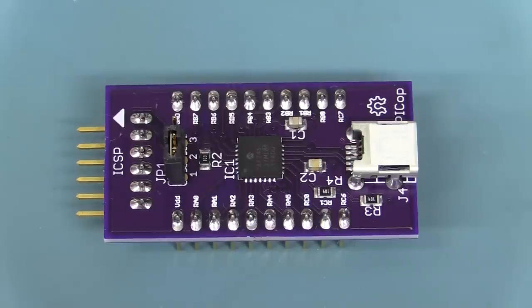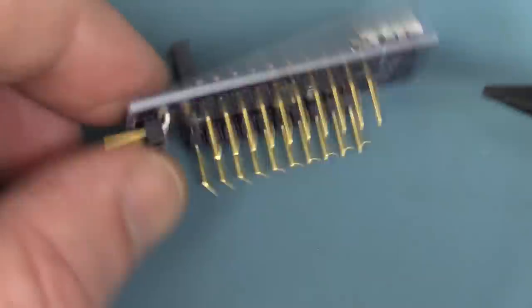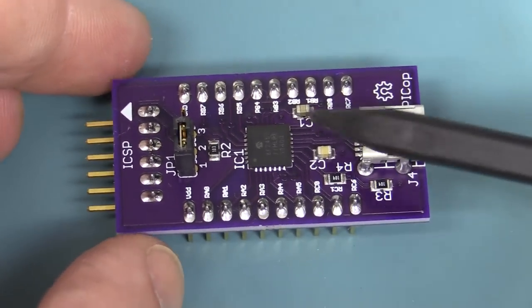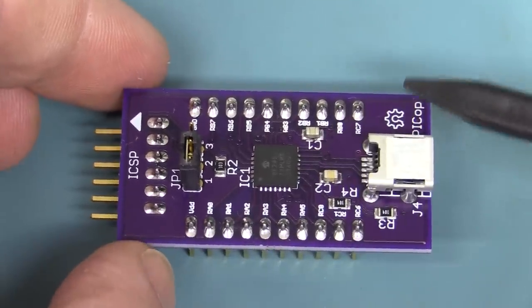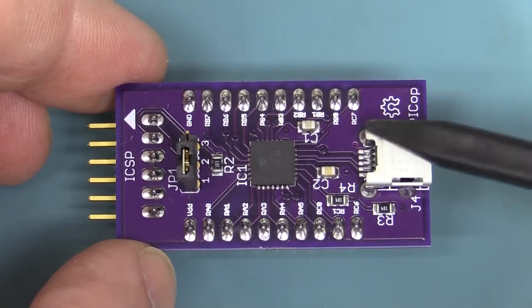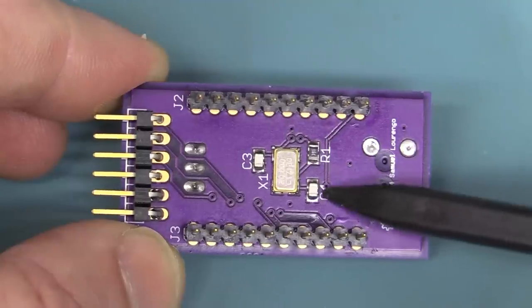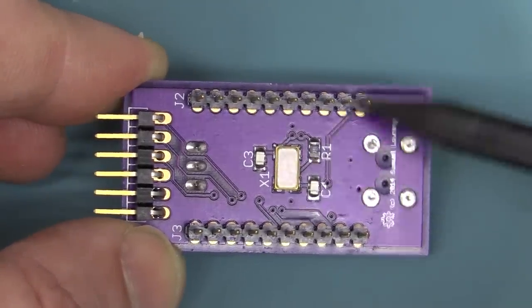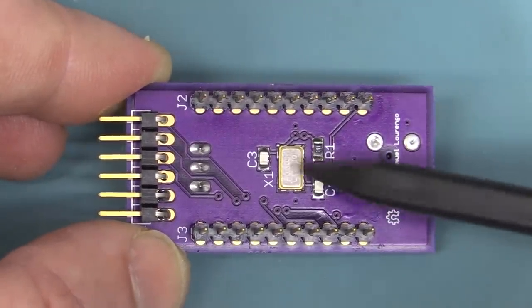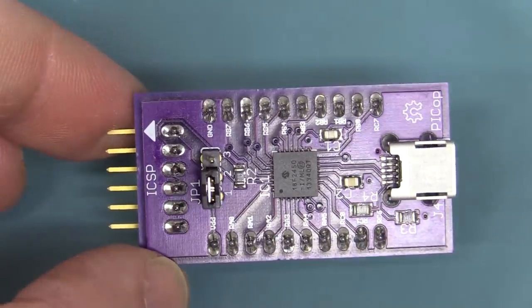He wants me to do a quick critique — there's not much you can do here. It's basically a microcontroller with a jumper. It's got a crystal on the bottom — that's actually a crystal, not an oscillator. The oscillator is inside the microcontroller of course. There is a difference between an oscillator module and just a crystal — the crystal doesn't do anything on its own, whereas an oscillator module will actually output the signal directly. The only thing you'd watch out for is any breaks in the ground planes. There's no ground plane wrapping around to join there — it's a genuine split. But we're not talking about any heavy currents here at all, so it doesn't really matter.